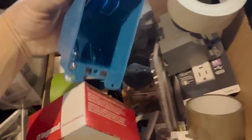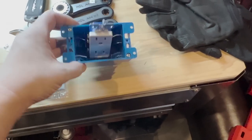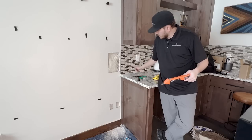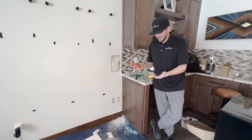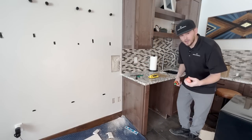Down here in the garage I'm getting into my electrical box and grabbing components for an outlet. I need a blue box, a single gang receptacle to keep everything up to city code, a standard power outlet, and a plate cover. I also have the Romex upstairs. Here's an outlet tester — I'm going to kill the power at the bar so I can relocate the power outlet. You plug it in to confirm it's wired correctly first, then trace the line back to the breaker, kill the breaker, and relocate the power.